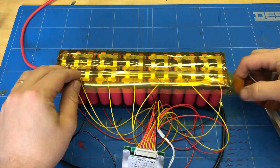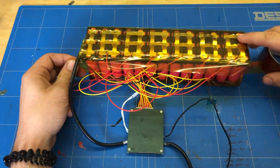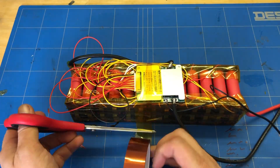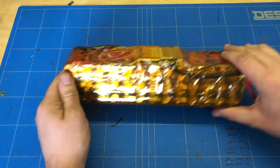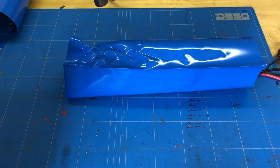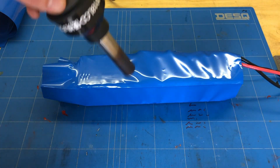The pack is done now, so I will cover it with heat-resistant tape for extra protection. There are a lot of wires but I try to make it as neat as possible. Then I have the big piece of shrink tube that wraps it all around and makes it really nice. It almost looks like the factory battery I had before, but this time with better cells.